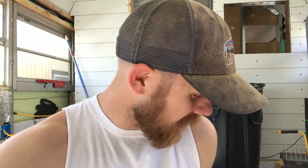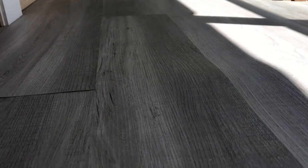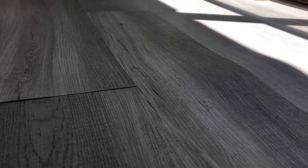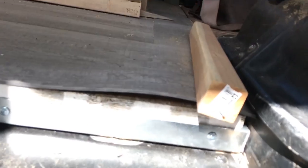At night it's getting cool and in the day it's just getting hot as hell. We spent $350 on this stuff — it locks together, doesn't need any underlayment, and you can install it on any surface. However, it doesn't do well in temperature changes. I'll show you what is happening to this floor. I have no idea what I'm going to do. We've already built walls on top of the floor and built the bench on top of the floor. It's got this huge wave in it right here, and this joint is completely buckling and pulling out. Another bubble there, and towards the front of the bus, just pulling right up off the floor. Huge buckling floor.